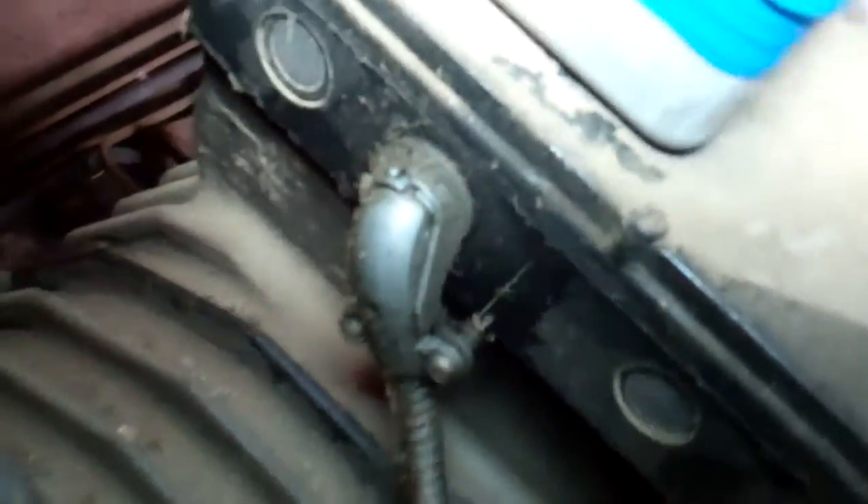We've got no cooling on this nice unit. It's been found, 3 horsepower. We've got power at the pressure switch. I'm just looking around it for any obvious signs or something that's not right. You can see the difference there - where the oil has come from. That is covered in oil, so I'm going to take the cover off and have a look in the terminal box.